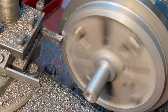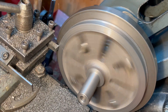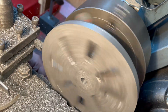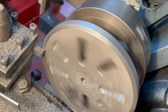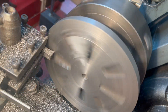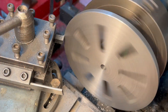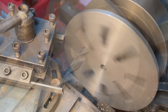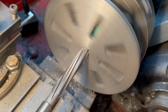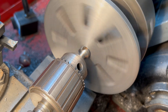Now we're going to turn this outside face down to half an inch total thickness for the top surface - that's quite a bit of material. After I've finished facing the bottom surface, I'll turn the rim and switch the whole thing upside down to the other side of the rim and then face off across the top. That's made quite a racket but it's starting to look quite nice. Just putting a tiny little chamfer on the corner, and then the last action is to drill and ream a counterbore for the hole through, presumably for a bush to hold some other tool in. Nice little chamfer there as well.